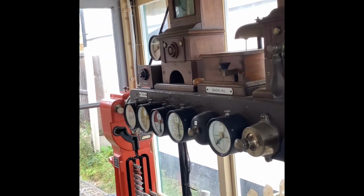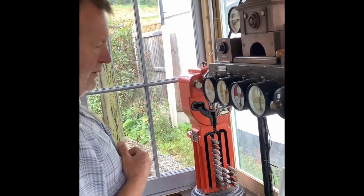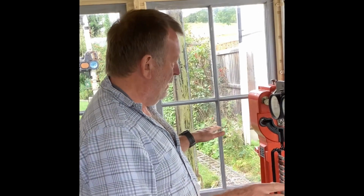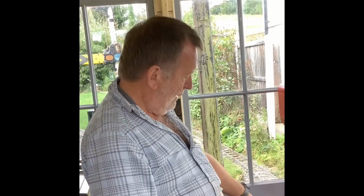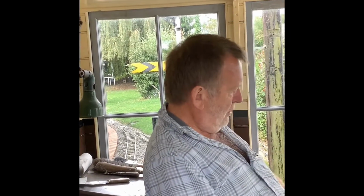Power supplies run off two feeders. The 240 supply goes to Beacon Hill box, and then it spreads out 240 down steel wire armour. If you switch the signalling on at Beacon Hill via the low voltage, it switches all these on. Because you want to switch it on and use remote operator, you don't want to keep running up and down. So all the power comes on at once. But I can switch it to local and get this power on just on its own.